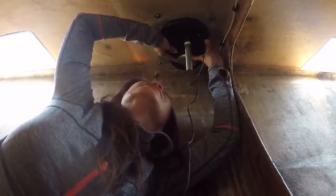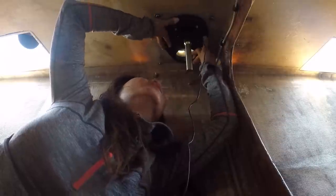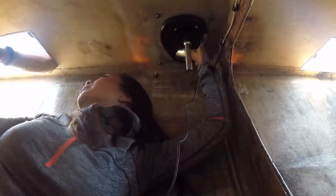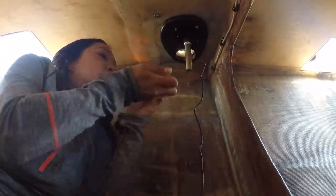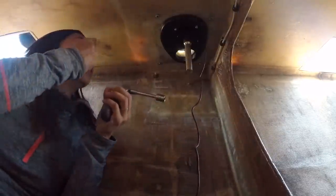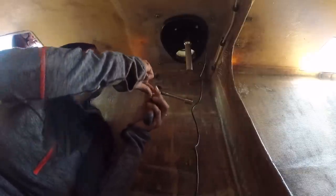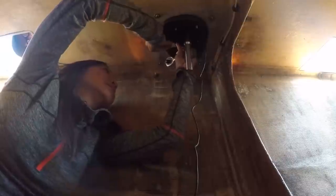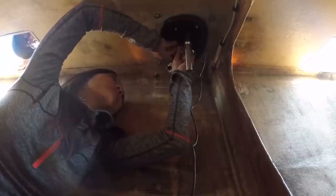I'm pushing down on the windlass - it's a little tight. Just wiggle it back and forth a bit. It's because of the butyl tape; we have to compress the butyl. I'm standing on this to put pressure on it. Once the butyl starts compressing you'll have more and more bite on there, so try to get one or two started.